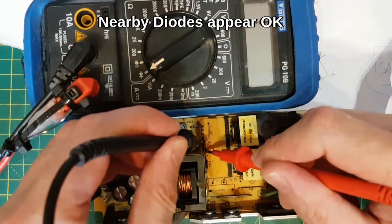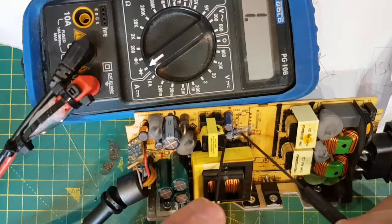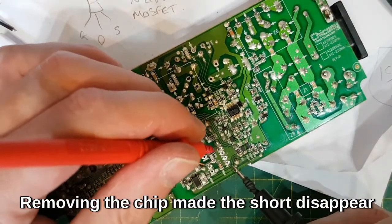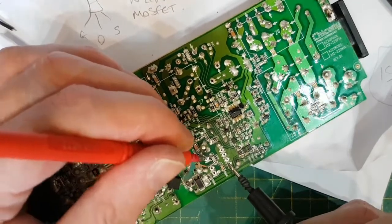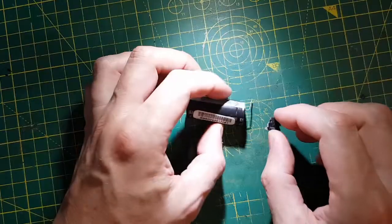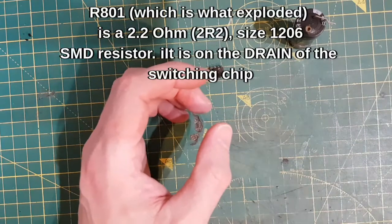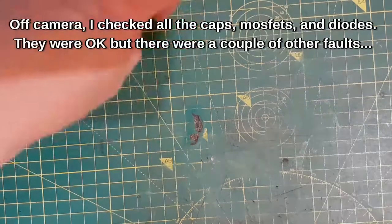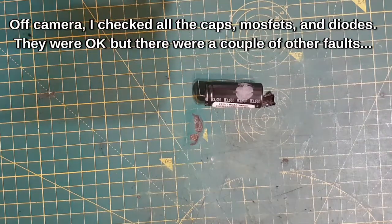Amazingly that survived. Testing the components — some are good, one has gone. So I'm pretty sure those were the faults. The main two faults: PWM chip and primary bulk capacitor. The third fault — or probably what saved the rest of it — was R108 or 801, a resistor on the board connected to the gate of this chip, which blew. I'll scavenge the resistor from somewhere else, clean it up, repair the traces and see how we go.